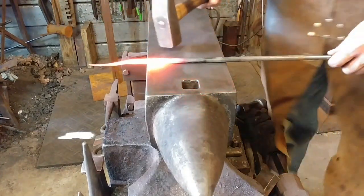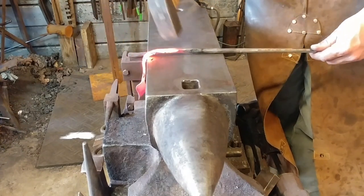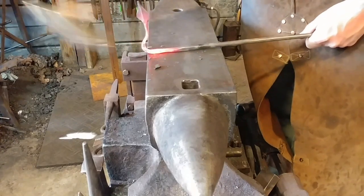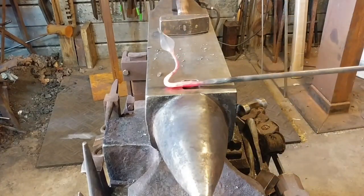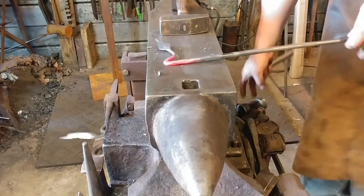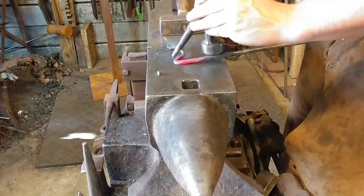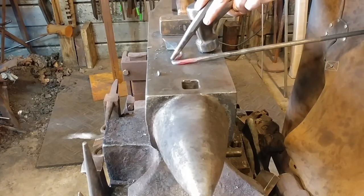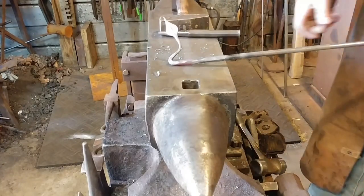Got it good and hot again. I'm going to figure out about three inches or so and just whack that down over the edge of the anvil — no big deal, we're just trying to make a nice bend. We'll start bending it back a little bit onto itself. It doesn't look much like a bottle opener just yet, and I would say you're exactly right. So the next step, we're going to come to the front of this and take a round punch, go half on half off with the round punch, and drive out our little catch for the bottle opener. I'll reposition the camera so you can get a little closer and see what that looks like.